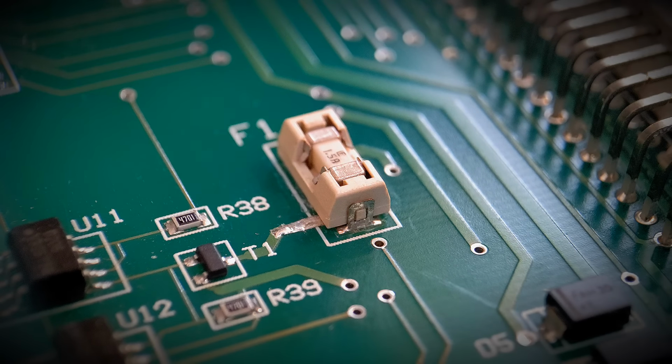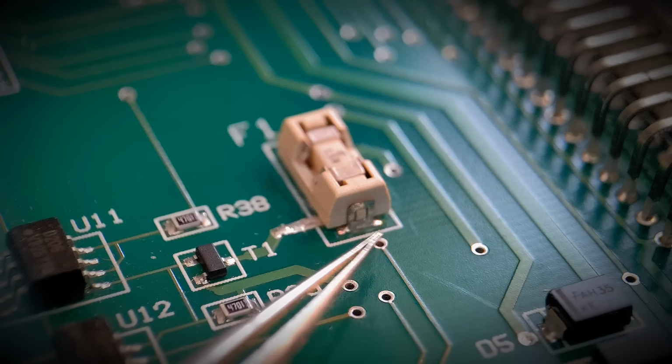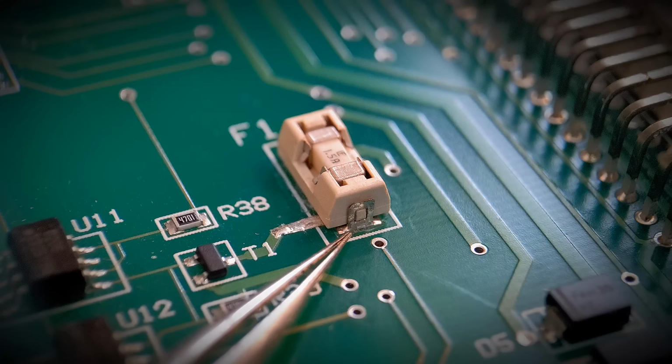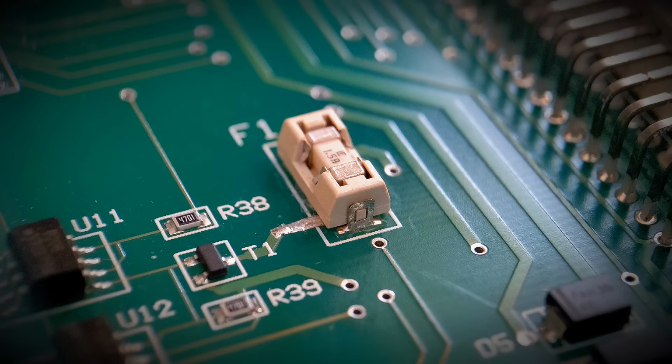So if you find that video on my channel, it's called Copper Foil Tape to the Rescue, you'll see this fuse holder damaged laying up in the air, and that's going to take you all the way through how I created the shaped pad underneath with a trace coming out of it. And you can create any shapes you want. So if you were doing this one down here, you could do the copper foil shape like this. That's a good thing about the copper foil, you can shape it however you need.